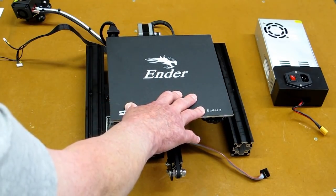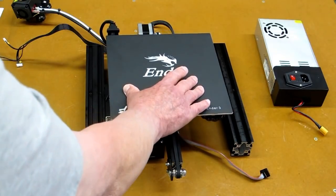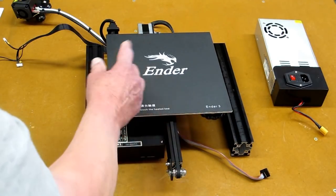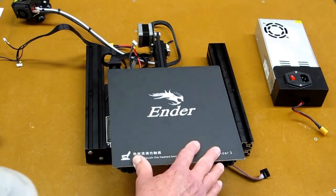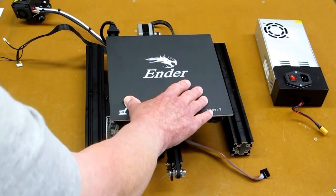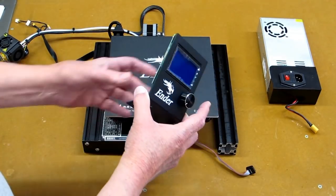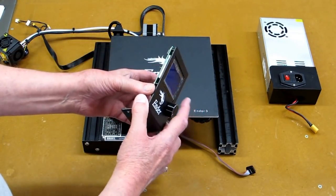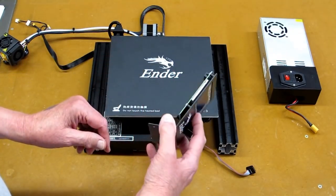It's like having your car parked outside on a cold day and getting flat spots on your tires. You can feel the three clunks because that little wheel has to go around three times to get from one end to the other. So if you feel that, the carriage is just a bit too tight. The back of the controller has been left open — there are a couple of designs on Thingiverse for a box or cover that will completely enclose it so you don't accidentally short it out with a piece of metal. Most of those attach with existing screws.